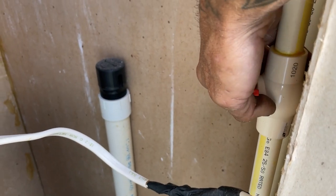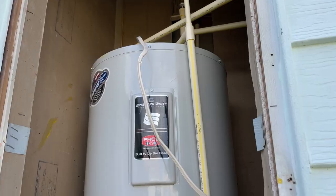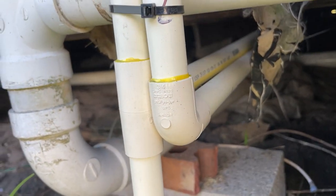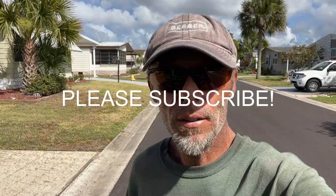I have no doubts that all my glue joints are good — it's just a matter of what's happening upstairs. Everything on the cold side inside looks great. Now it's time to fill this water heater up. The heater is full of water and I don't see any water dripping. I'm going to wait till everything is fully pressurized and check the meter to make sure it's not running. No leaks — panels all back on, water heater back in place, everybody's happy. Everything went off without a hitch, happy customer, and we got it done in one day. Got any questions? Leave them down below and don't forget to keep plumbing.